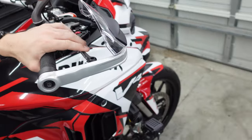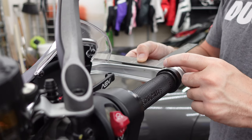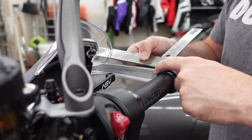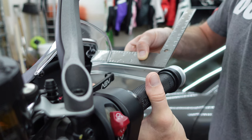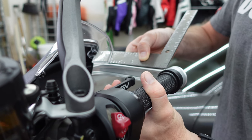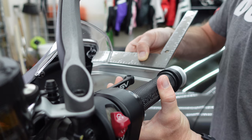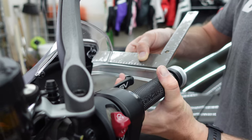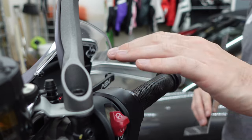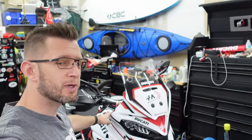As I mentioned last time, I'm sitting a ruler right at this edge so we can repeat the measurement. If you remember how far back the lever was coming — we were getting it almost to the one-inch mark. Right now we're starting at a leading edge of about four inches, and when we pull it back we're getting to about two and a half inches — so about an inch and a half of travel. It is consistent: it does not change pull to pull, and that first pull does not bring it back any further.